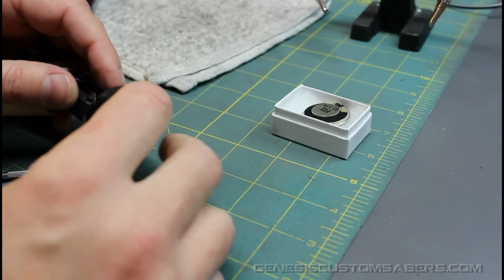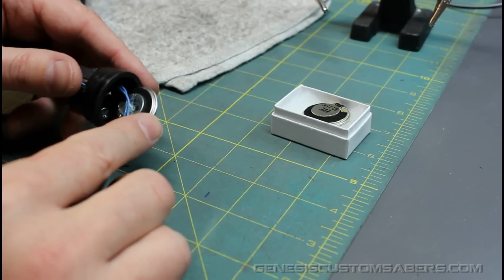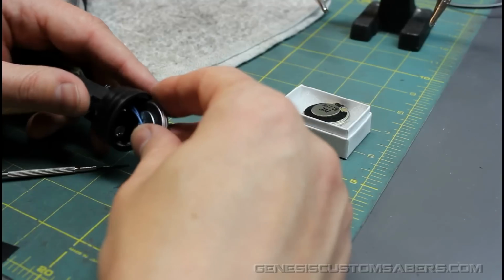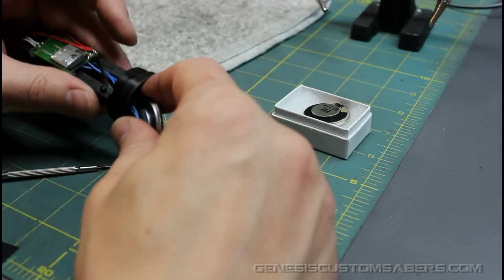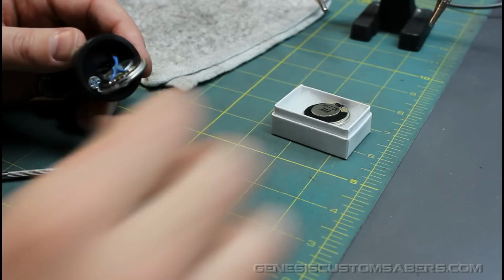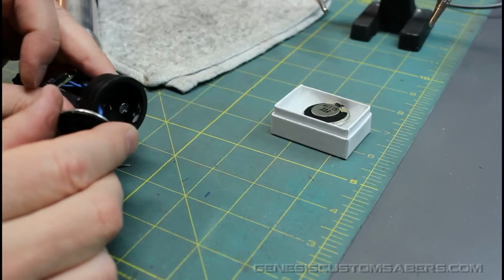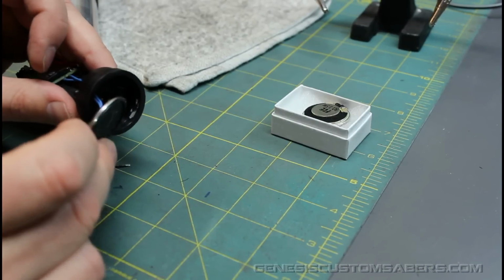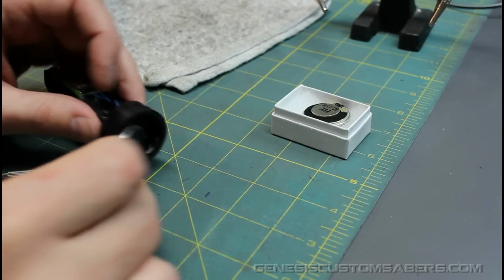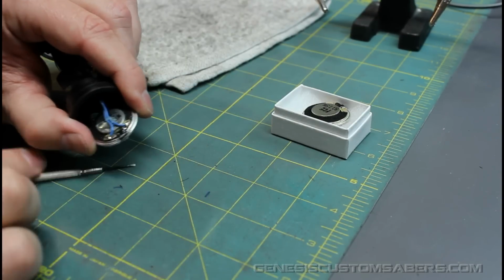My speakers have a little bit of hot glue on the back that keeps the wires from breaking free of their soldering posts. So I'm going to pull those wires fairly tight without damaging the electronics, so I can get access to it. In my speaker mounts, I've also got a little bit of gray putty, which you may be able to see inside the ridge. That keeps the speaker from vibrating. You want to make sure that putty is nice and spread around, but we'll do that again when we reinsert the speaker. For this, we're pretending that this is a damaged speaker that we want to remove.